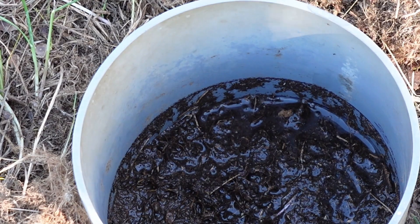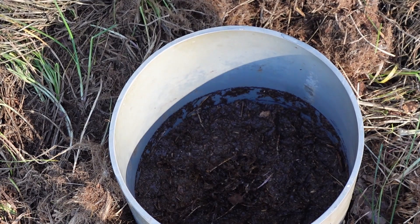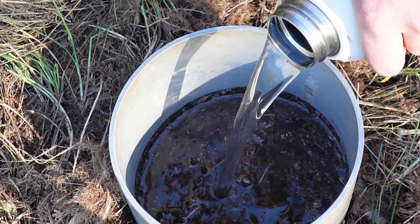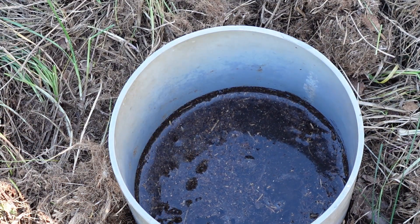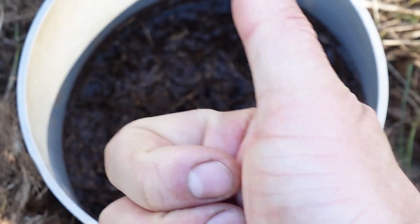Here's a time lapse of what it looks like going all the way down. Now that it's done, we'll start the second test, which is the one that we're actually going to be recording. Fill the water all the way back up to the same level — and let's speed through this process because it takes a while. You're completely finished when there's a wet glaze over the top of the earth and there's no standing water in it.